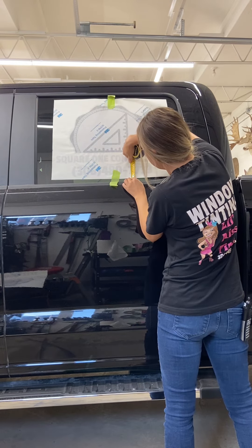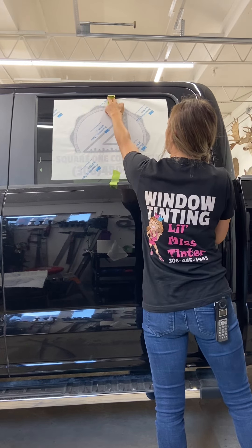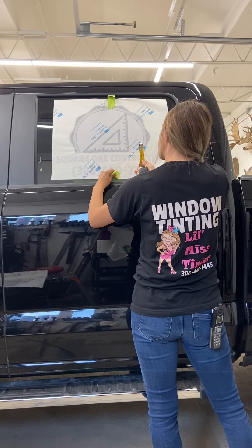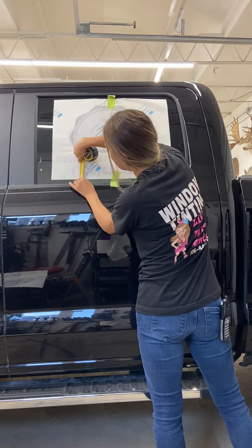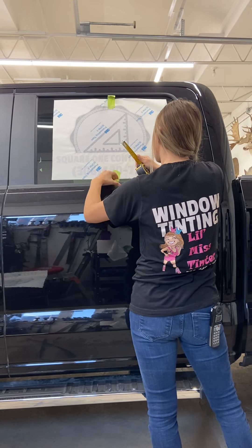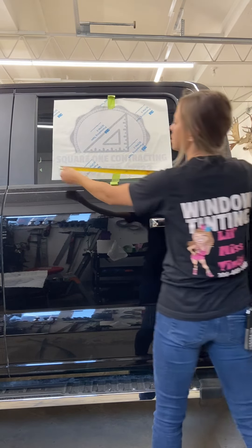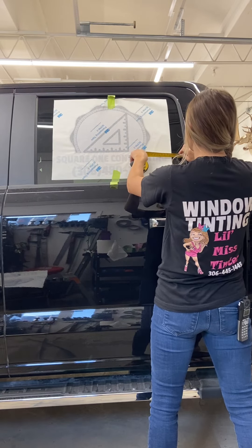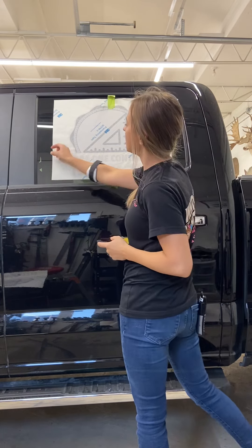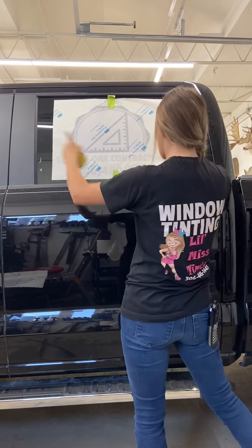I'm at an inch and a half so I have to move it just a little bit. If you tack your top piece down once it's straight side to side, put your tape down on the top and leave it — now you can just rotate it side to side without changing the side-to-side distance. I'm just off a slight bit — inch and a half and inch and a half — now I'm perfectly straight. Always double-check that the measurement didn't move, because if you had it really crooked and shift it to correct, it can also shift the side-to-side position.